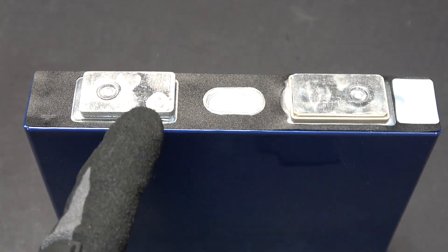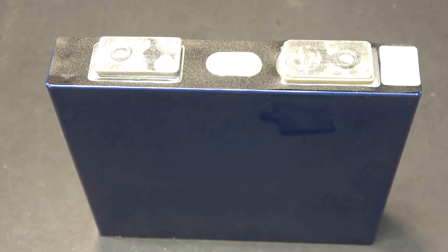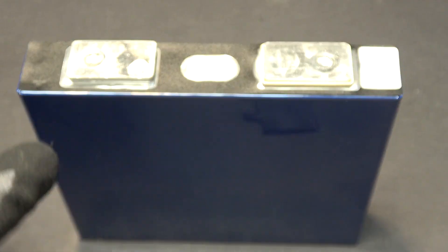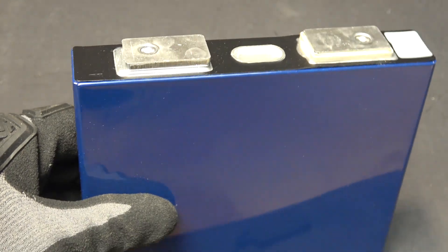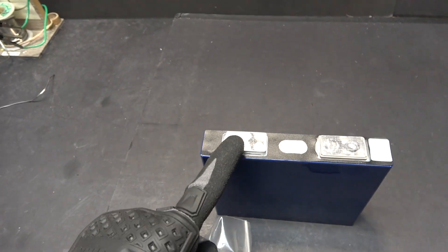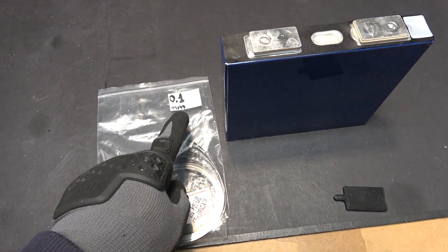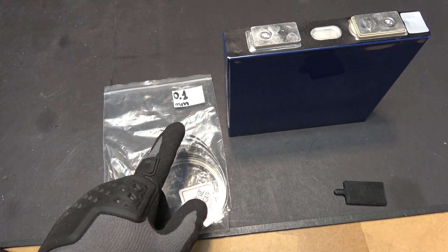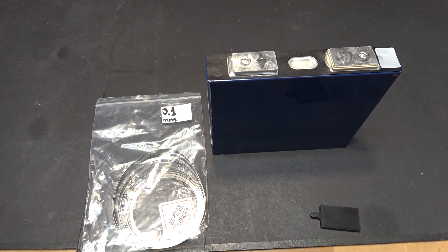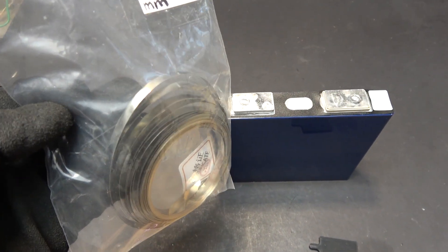Both of these terminals are aluminum so soldering is out of the question. I can spot weld it, but spot welding aluminum is tricky — unless you have a very strong spot welder, this won't work either. Plus this battery is 50 amp hour so the discharge rate is 50 amps continuous. I have nickel strips and I could probably spot weld them on the terminal, but nickel strip is only 0.1 millimeter and my spot welder can only do 0.1 or 0.15 millimeter. I need something that can handle 50 amp discharge and a 0.1 millimeter nickel strip won't do that.